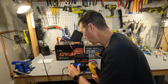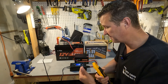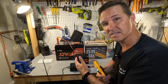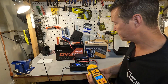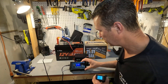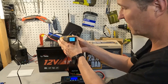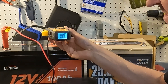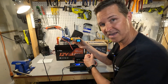Let's switch to the next level: 10 amps. As you can hear, the fan has sped up for the higher charge rate. The display shows 13.9 volts at 10 amps. Testing with the clamp meter, we are getting right at 10 amps — 10.05 amps. So far we're right on the mark.